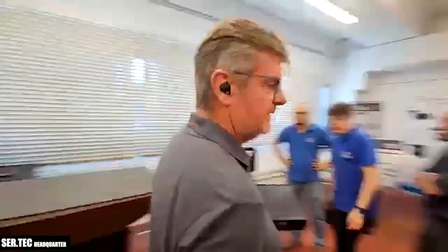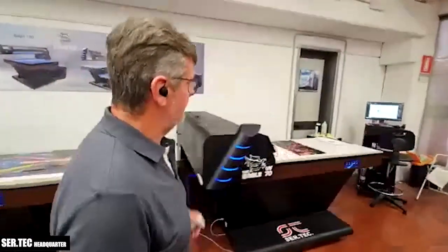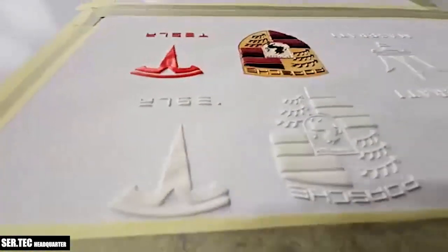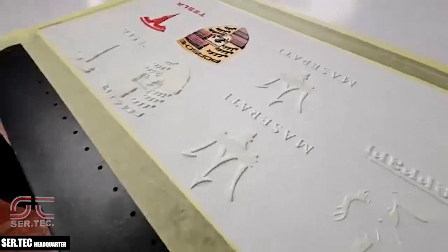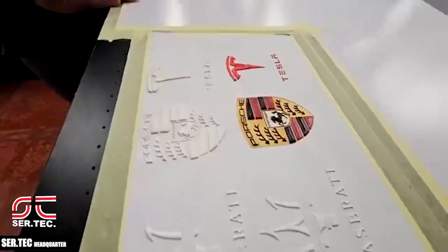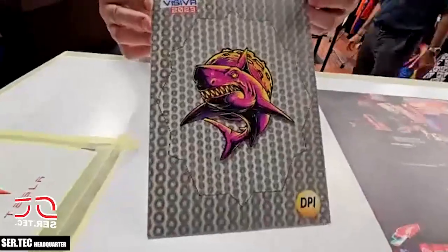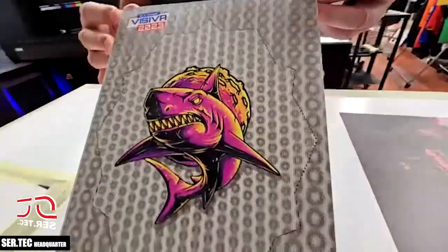In this part of the company, for example, we have our new UV printer, still based on Ricoh technology, with the 3D effect. This is one of our added values that we can offer, different from the competitors, who normally apply embossing or a 3D effect by glossy varnish, but this is not applicable for flexible material. Another application is the 3D effect that we can provide with some special software functions to offer to customers.